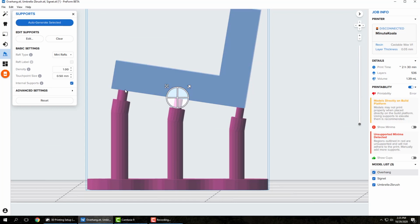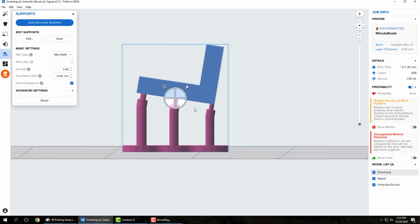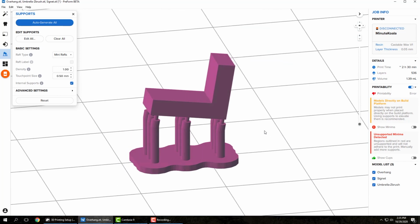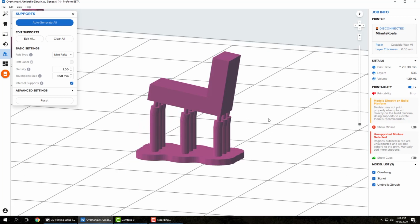And we're not going to leave this bottom surface flat to create that kind of filleting. We've put it on a bit of a gradient, so we're actually going to get a much smoother surface on the bottom, and this entire piece is going to remain much more dimensionally accurate. So that's the gist of our support theory side of it.